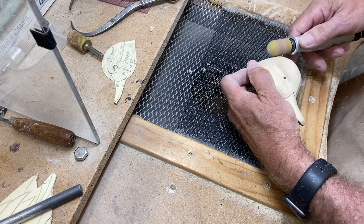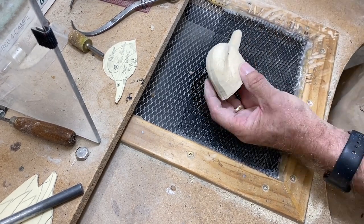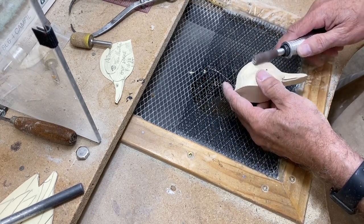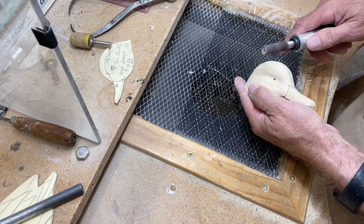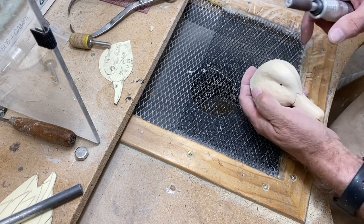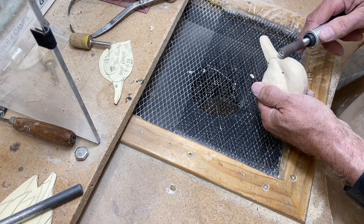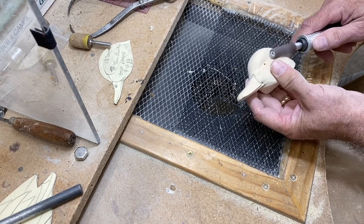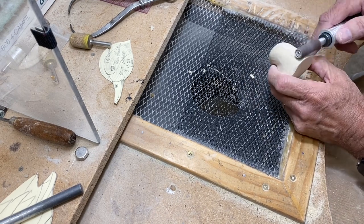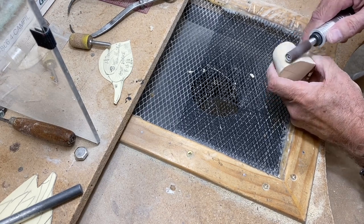I've got that rounded to roughly where it should be — you can see how round it is from the front. Now I'm going to use a sanding drum with about 120 to 250 grit to do some rough sanding, taking out grinding marks, tool marks, and flat spots. I still have the center line on the head and I want to keep it there — it helps maintain the profile we worked so hard to draw during the pattern stage. Leave that center line on until the last thing sanded before you seal the bird.